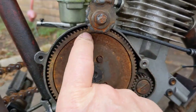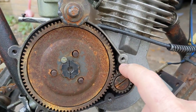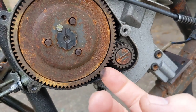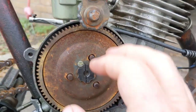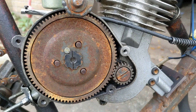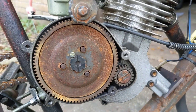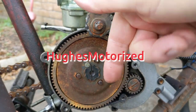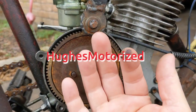You don't have to run any grease in there. But if you've got a lot of grease in there and you have a leak at your crankshaft seal — oil and gas getting in here — you'll fill up the clutch area behind this plate, getting grease on the pads. Hopefully I've helped somebody out. Give it a thumbs up if you like it, and subscribe for notifications. I want to thank each and every one of you for watching.